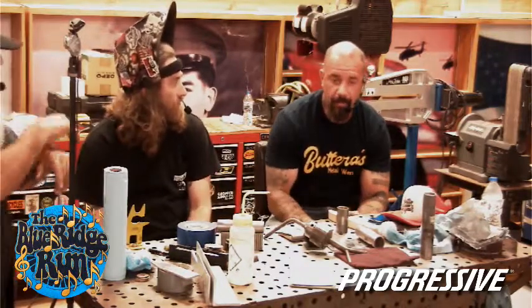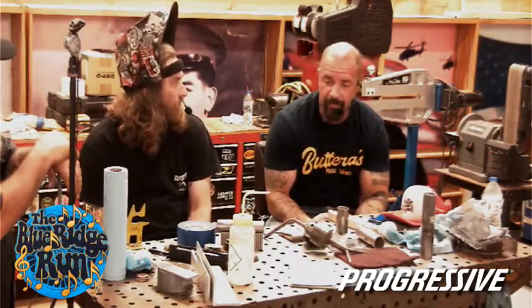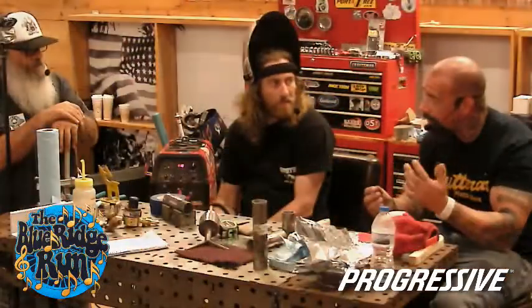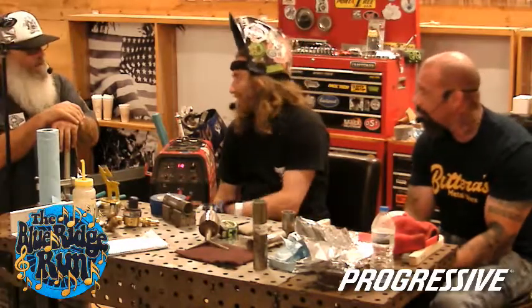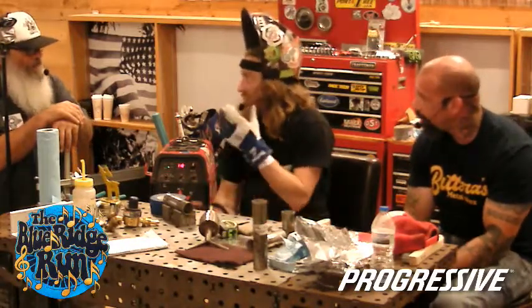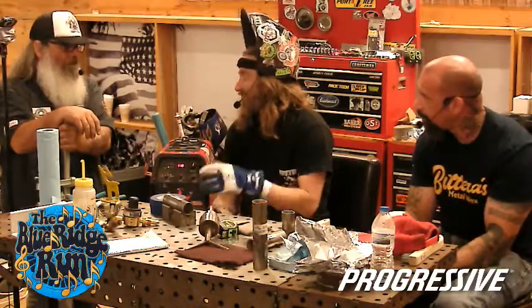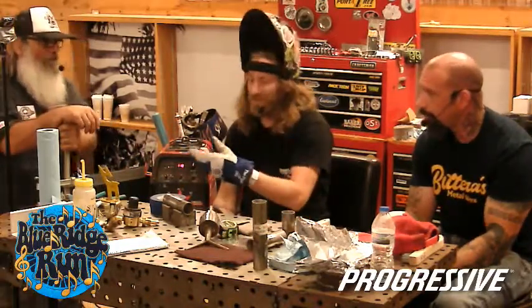I think structurally it makes a big difference as opposed to just relying on drawing those two metals together to fuse themselves. You will get a lot of undercut, because you're not adding material, you're taking it away from the two. But if you have really good fitment and you have a quick pulse, you can fusion that spot with very low suck from either side.